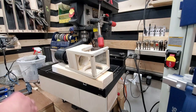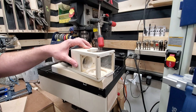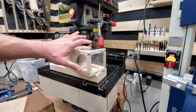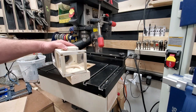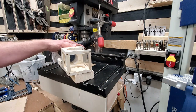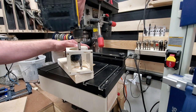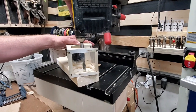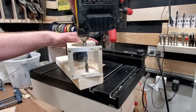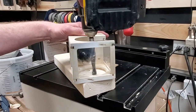What makes this design truly different is that I can use it away from the actual drill press. If I'm using my handheld drill, I can still get dust collection and drill anywhere. Here I'm using it on the drill press table, but I can take it over to my workbench, attach a hose, and drill a hole. As I zoom in, you can see it's sucking all that dust right into the hose and leaving virtually nothing behind to clean up.